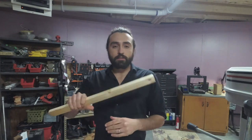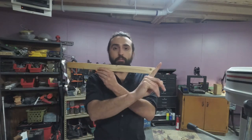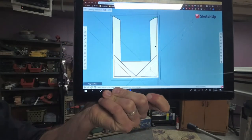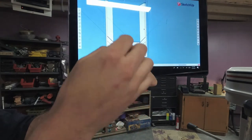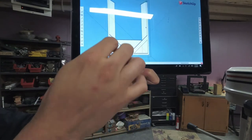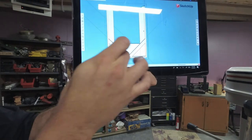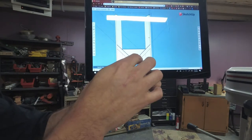So what I need to do is support them. As you saw, I made the wraparound shelf design on the ledgers, and I'm going to put in some 45-degree angles. Here's kind of what I drew up — this is the shelf layout, with the door area here, looking from the bottom up underneath it. We have our 6-inch shelves on the sides and the 12-inch shelf coming from the back of the pantry. I'm going to put in these supports on the ledgers so the shelf will be supported here and the 6-inch shelves supported here. We're going to cut 45-degree angles and then set our shelves down on top of that.